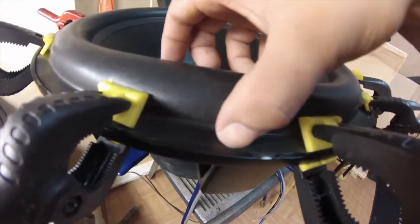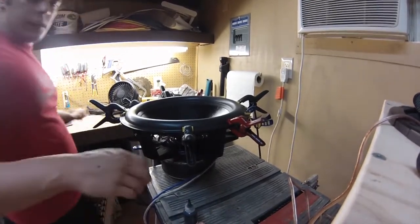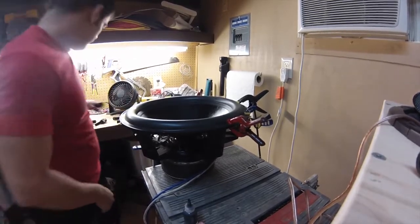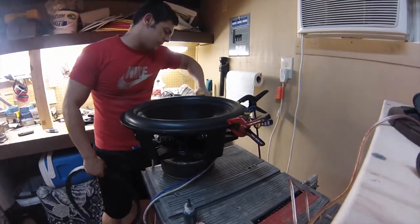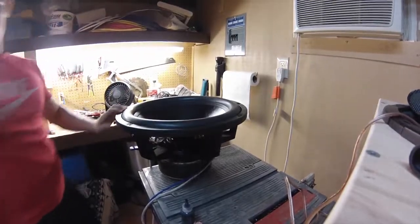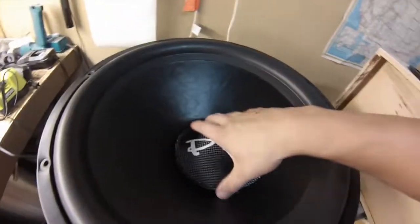Don't want to move that for a while — you want it to dry. We're done pretty good so now we're going to take the clamps off of that, take the clamps off the surround. Now we put a rubber gasket on — put the rubber gasket on and take all these clamps off. I waited about 30 minutes for this to dry. There you go — we have a gasket back on our woofer. We still have our shims in here so we're going to take those out. We got the dust cap over there — our PSI dust cap. Nice beautiful carbon fiber dust cap — going to lay it down right there. Let's pull the shims out first.